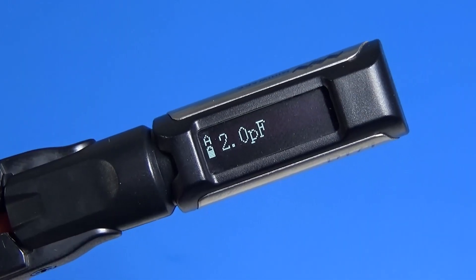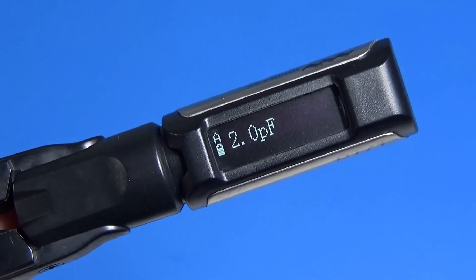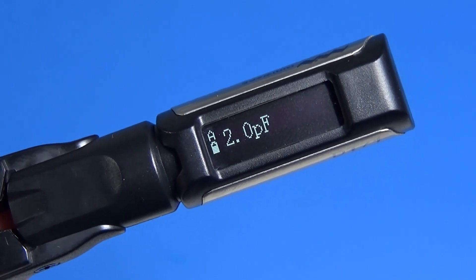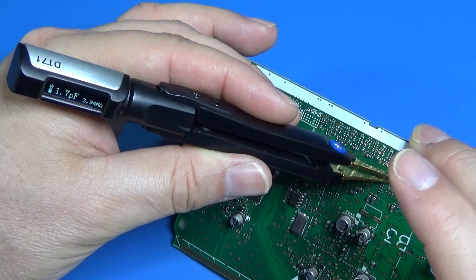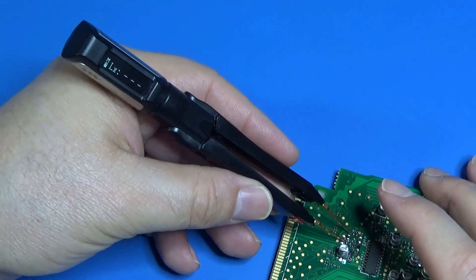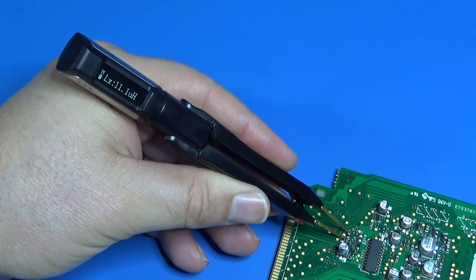Anyhow, we also have a high probability to get the right device. If the capacitor is a 0.1 µF capacitor in parallel with all the load and the rest of the capacitors, we will get an unexpected measurement — whatever we get is correct, but maybe we will detect the resistance of the whole circuit, or if we have 50 capacitors of 0.1 µF we will get a huge capacitance. So it's a little bit tricky and we have to understand what we are doing.